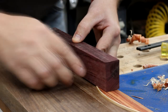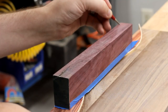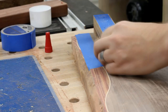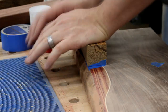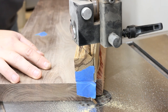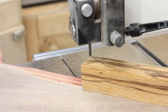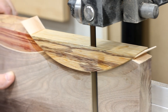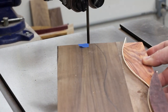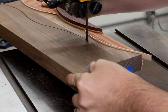Then I figured I could work in some purple heart as well. I lined it up just where I wanted it and fastened it down just like before. I drew on a guideline for me to follow, and then cut it out over at the bandsaw. Since that worked out so well, I glued on a piece of marblewood on the other panel and did the same thing. Any excess that stuck out the top got trimmed off so that I could keep things pretty flat for whatever piece of wood gets added next. When I couldn't fasten pieces on top of the panel, I had to glue them onto the bottom — here I added a piece of Ipe that was under the panel during the cut.